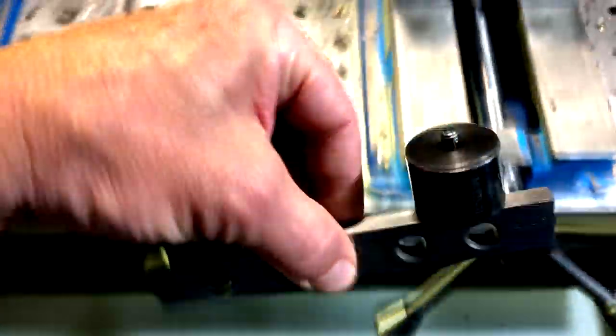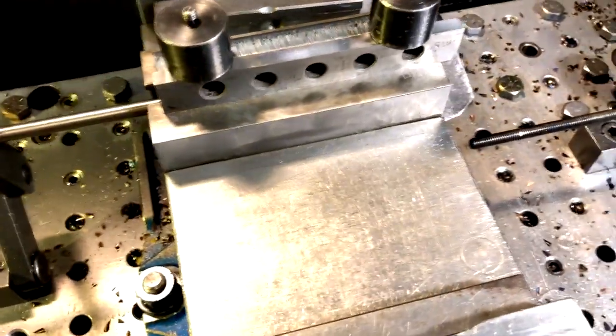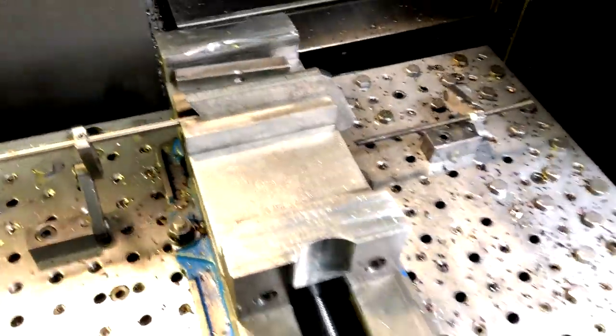It's crooked. I can keep bringing it up, but how do I do it if I need it flat? Here's what I came up with: I just took a seven-eighths parallel, put two magnets on it like that, and there you go. Tighten the vise and we are ready to put chamfers on.